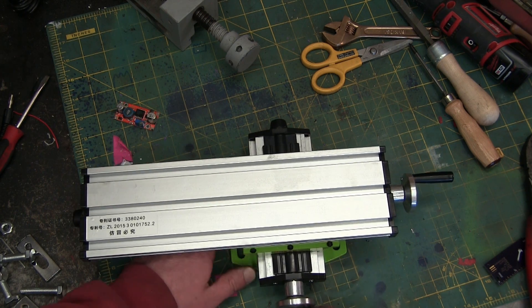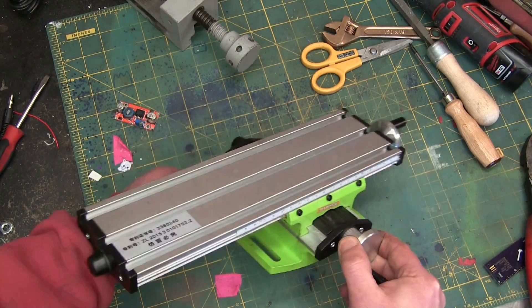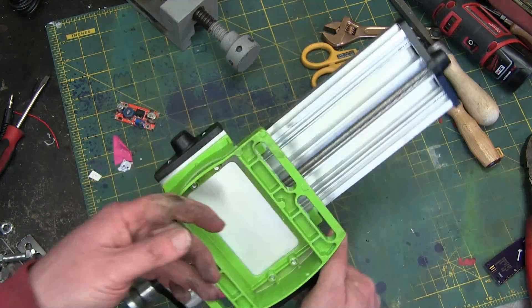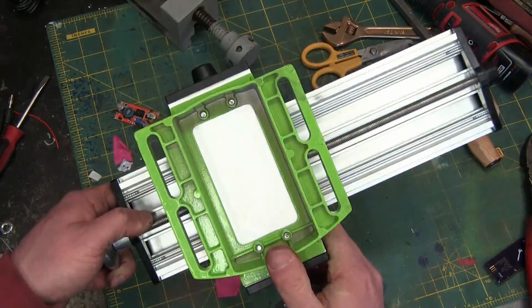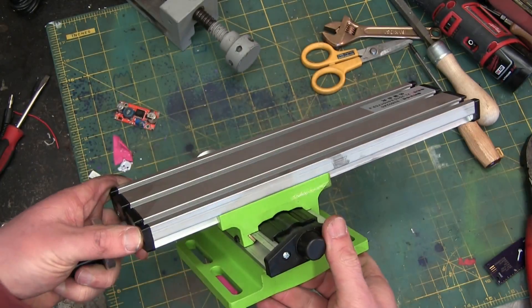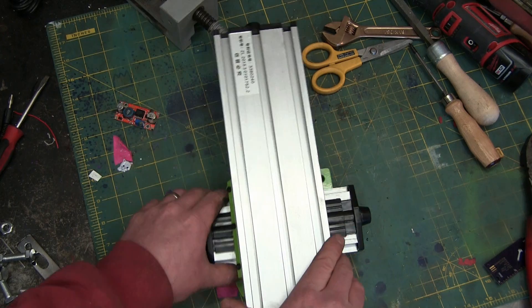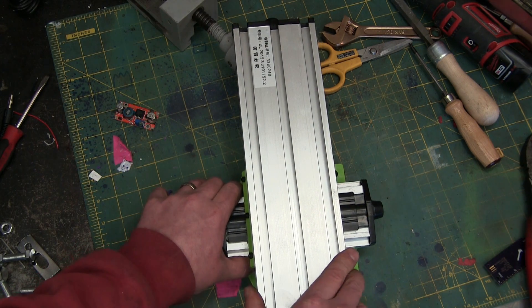This has two axes, square to each other, on threaded rods that advance or retract as we turn them. Very rigid setup. We need this — it's very convenient in order to mill out pockets, square areas, or flatten things out perfectly. I ordered this from the internet — came within a week, paid $20 shipping and $12 for the entire unit. All aluminum, powder coated. For the price, I'm pleasantly surprised. It's reasonably rigid, does have some wobble, but nothing we can't overcome.